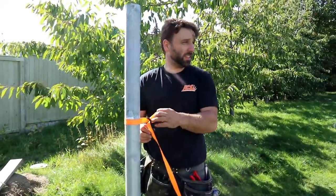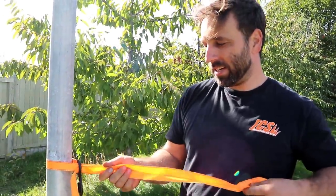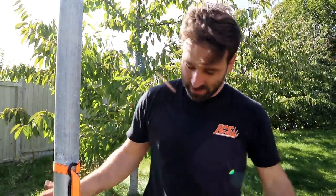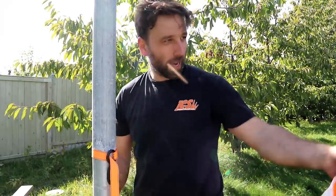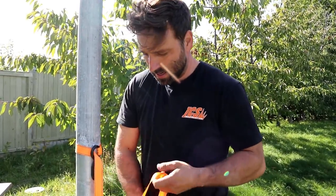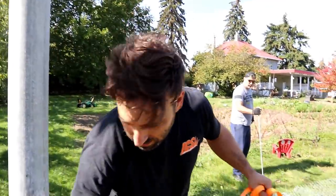You need to get tension in the mesh, so you do that with some straps. There's a little jig thing you can have if you're a professional, but I'm not a professional so I do not have that — just ratchet straps. Going past the post that I want the mesh to tighten up against, tightening up the mesh, then you can put the tension bar through, cut the extra section off, and it's fully tensioned.